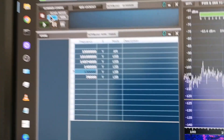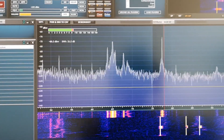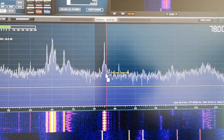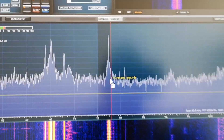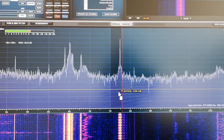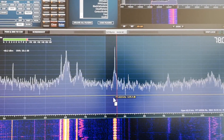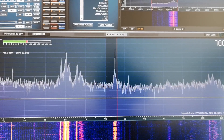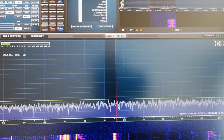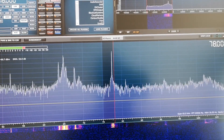Going to the lowest frequency I've stored - 78 kHz preset - which is really listening to the 77.5 kilohertz DCF77 signal, the very accurate time signal. I'm listening on lower sideband, which is why I'm tuned half a kilohertz higher. There's the signal with its pulsing and modulation for DCF77 on the mini whip - a nice healthy signal. Switching to the long wire, nothing. Switching to the loop, maybe a tiny bit of something, not really.